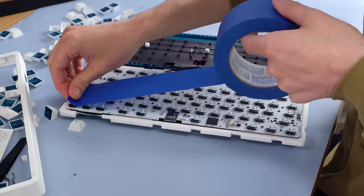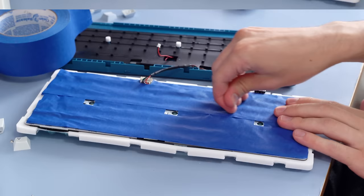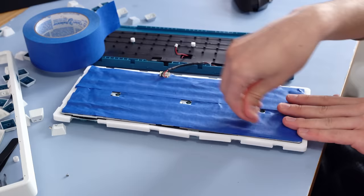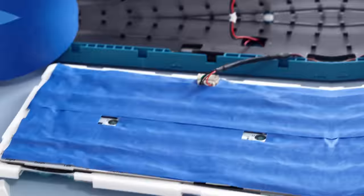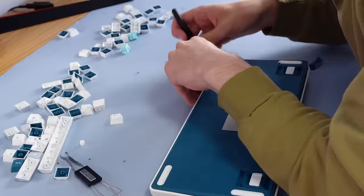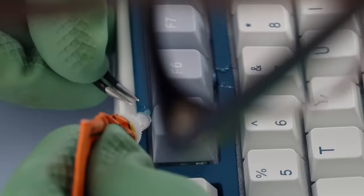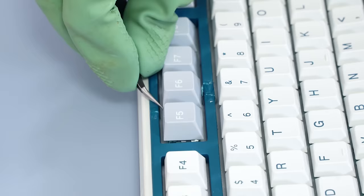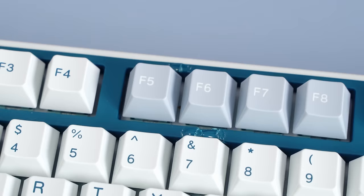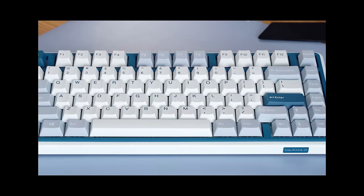I said I could get it quieter, so I'm going to try my best with the tape mod. There honestly wasn't that much I could do to the case, but the tape mod tends to make a board sound a little deeper and poppier. I put three layers of tape on the back of the PCB and flattened it out — one of the most simple yet effective mods. Then I used super glue to reassemble and pretended the breaking never happened. No scuffs — well, there might be a few scuffs.